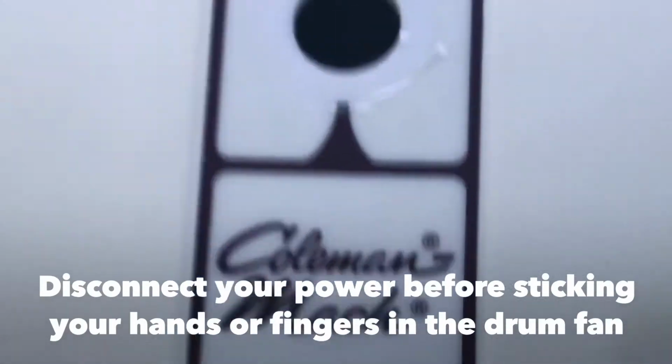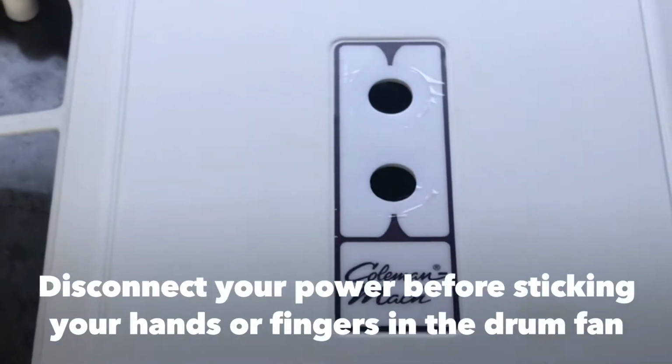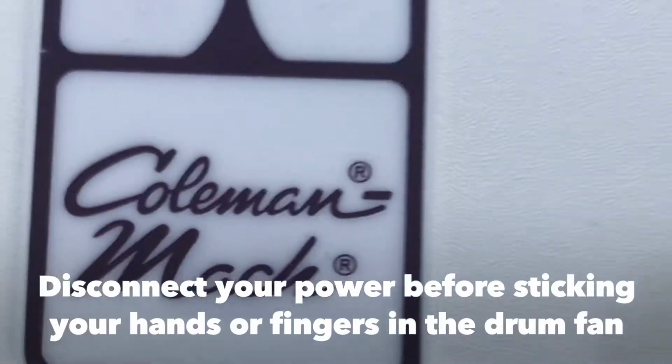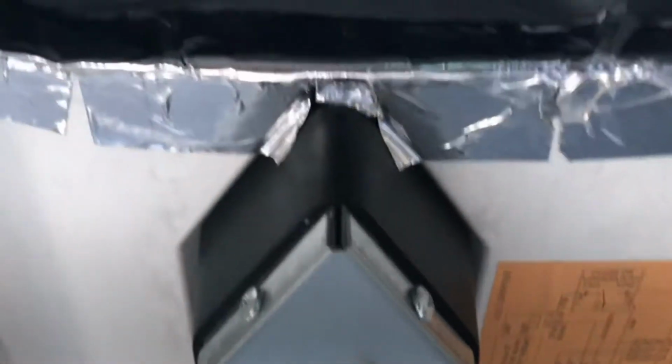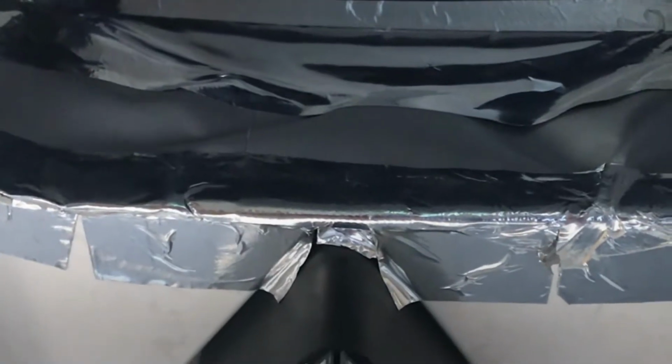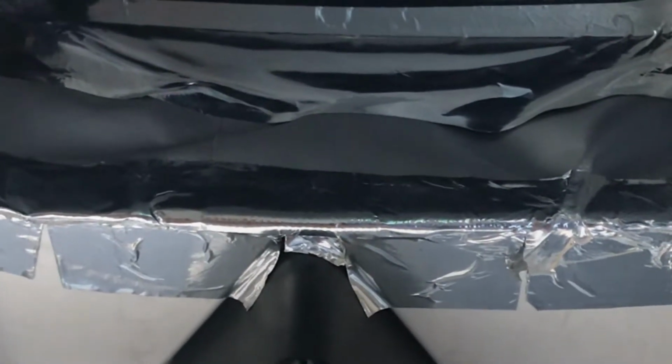Forest River. Air conditioning not cooling properly. It's a Coleman Mach. It's getting down to about 76 and then kicking off the compressor. So you still hear the fan running, but the compressor was kicking off, so it wasn't cooling the unit.